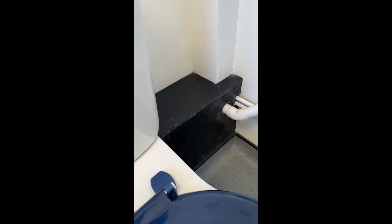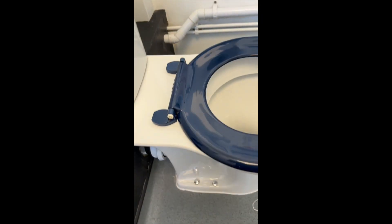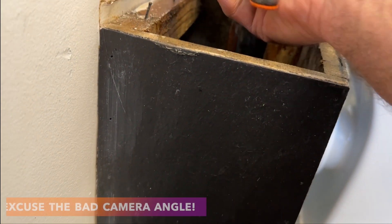I'm going to drill a hole in the top of that shelving and see if I can get it in the right place. I've taken measurements — the service valve is 750mm from the edge. So I'm going to drill maybe a 25mm hole there and see if I can get my screwdriver down to turn the water supply off. I can just about see the isolator valve down there, so I'm going to turn this off and then we can fix the leak.